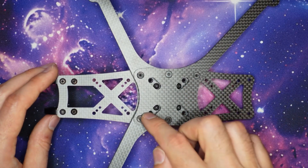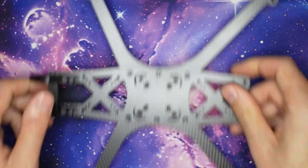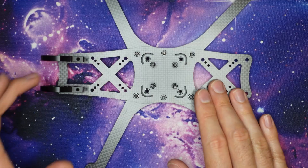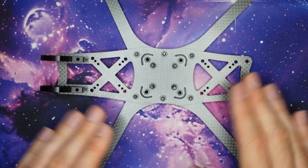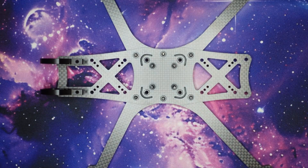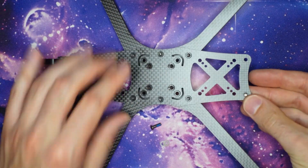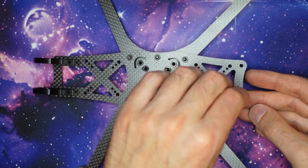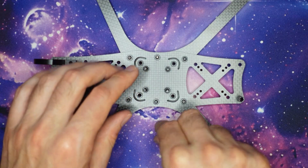If you're using a 30x30 stack you're going to be using the outer screw holes, and if you're using a 20x20 stack you're going to be using the inner screw holes. Once you have the stack screws installed it's a perfect time to assemble the rest of the electronics into the frame including the camera into the camera cage. Once you've done all that, we're going to install the standoffs and then do the final frame assembly. To install the standoffs, take the two medium length button head screws and the two M3 washers, go to the back of the frame, slot the M3 screws through the plate, put a washer on top, and then take one of the 20mm M3 standoffs and thread it down onto the screw. Do exactly the same on the other side.